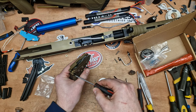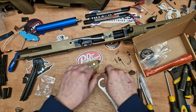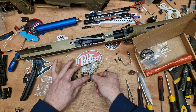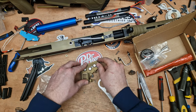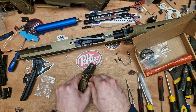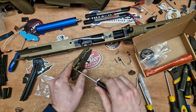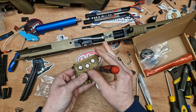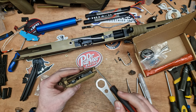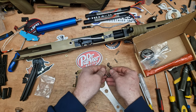Let's see what we've got in here - some nice thin shims, thank you Silverback. That's the thick one we don't want. Pop this back open, add the thin shim - I'm gauging off the movement I saw when it was together. Pop it back together. The more times you shim this stuff, the more of an idea you'll get on how much you need to change. I've been doing this for a long time - don't be frustrated if you don't get it right the first time, just persevere. They give you plenty of shims in the package. We're spinning nice and freely, side to side play is within tolerance. You have to be careful putting these screws in - I've seen a few of these thread really easily.